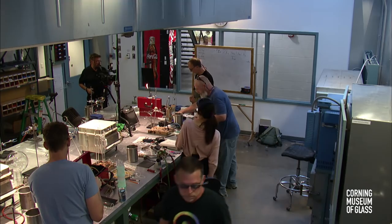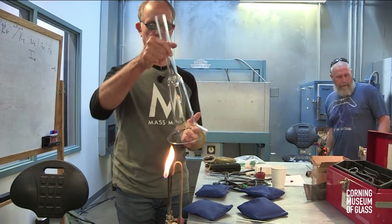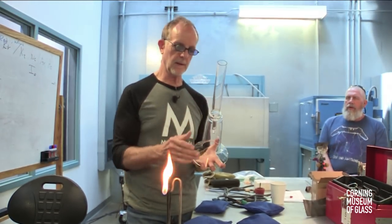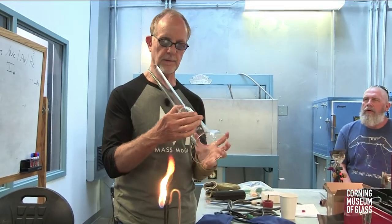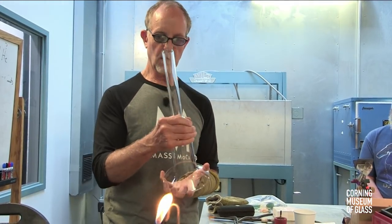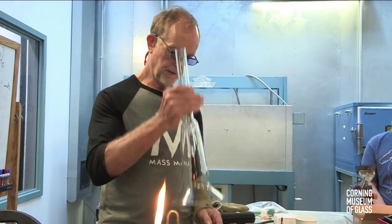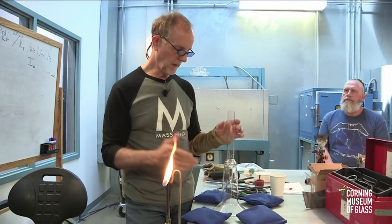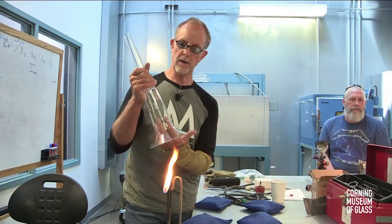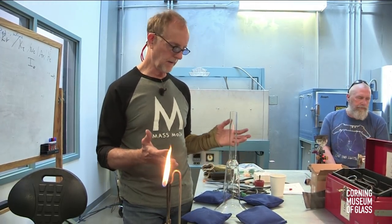Okay, so right in front of me now, I have a piece that's been made and annealed. The reason I really couldn't work with the one I just made on the lathe is because this seal here is very highly strained, and unless you keep it warm or anneal it, it's probably going to crack. So the function of this, not only the obvious, is to hold the piece up, but a wire will go to an electrical jack right here. And when it's sitting like this, all the wiring is completely covered and very, very safe.